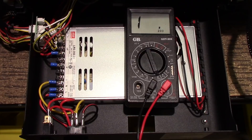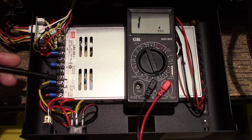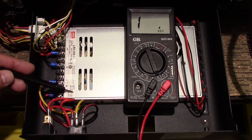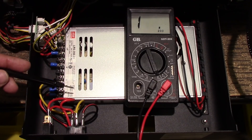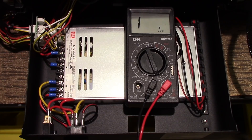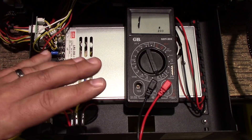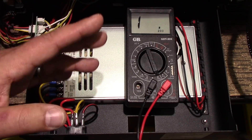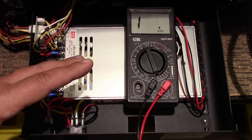Here's the case: maybe this wire here, which is energized, maybe I have a bad ground, this rubs through here — that's going to create a short, that could create heat, that could become a fire hazard. Don't let the printer run. I don't care what you're printing — if you're shocked by something in your shop, shut everything down until you sort it out. Your life is not worth printing something.